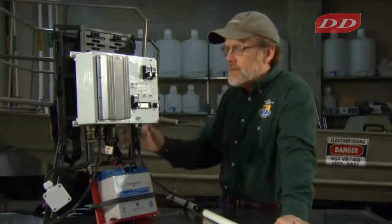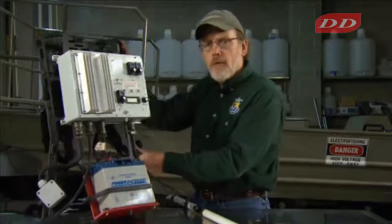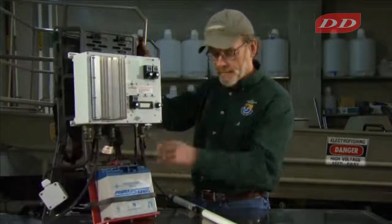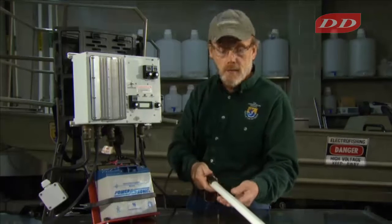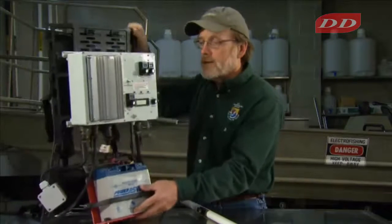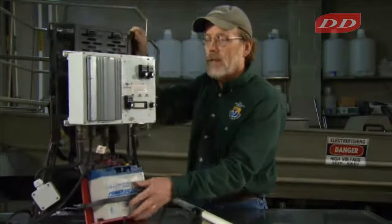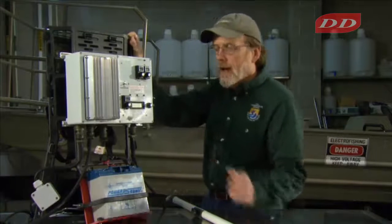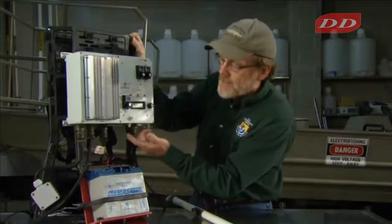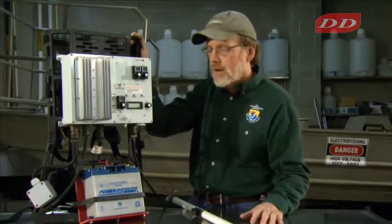Now, as far as some of the other safety features of the unit, there is an internal tilt switch. So if you go too far forward, the unit assumes you're falling over and it shuts off. Then you have to stand back up straight, take your finger off the safety switch on the anode pole, and re-engage to get it started again. Often it's 50 degrees forward, side to side it'll tilt 45 degrees, and then backwards 40 degrees. So the unit is sensing that you're falling and will shut off. Now if there's a vertical fall, so if you're walking along with the unit and you fall vertically, there's a water immersion sensor, and that is this object here. If water contacts the immersion sensor, then the equipment shuts off at that point.